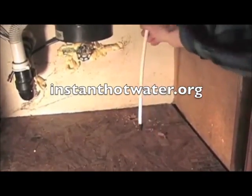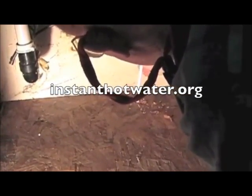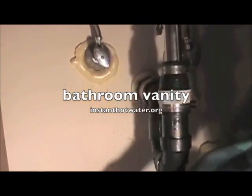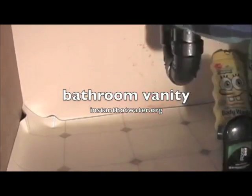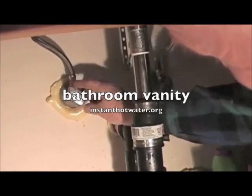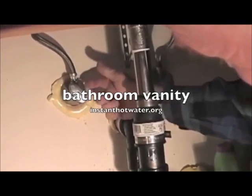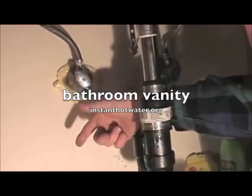And now we've got to go to the bottom of the cabinet and the floor, which sometimes takes a bit of feeling around to where it goes. Underneath the bathroom sink now, and we'll bore another hole here and bring the 1/4 inch line up, and we'll connect it directly onto this here. So we'll turn this valve off and unscrew this riser tube from it, and we'll connect that onto the new 1/4 inch line that will go directly to the hot water heater.